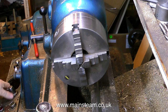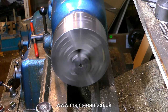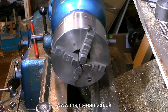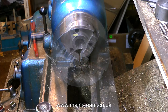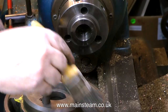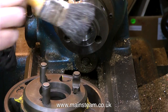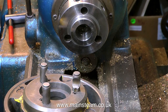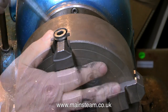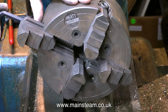It's at times like this that I'm quite glad I don't have to machine 10 of these. I'm just going to machine the one and I'm going to show various different ways of doing it. In order to machine this casting I do need a lathe, and I'm using the larger of my two lathes — my old Smart and Brown model 1024 — currently changing the chuck from the normal four-jaw self-centering chuck to a very old four-jaw independent chuck. The first thing to do is to clean any swarf present on the chuck back plate and the lathe register, otherwise the chuck won't run true. The chuck system on this lathe uses the cam lock system, which is a very quick way of fitting big heavy chucks onto the spindle.